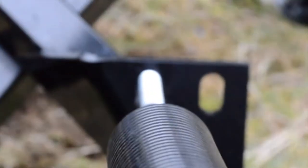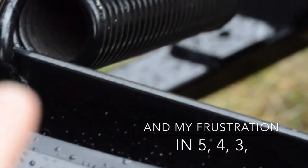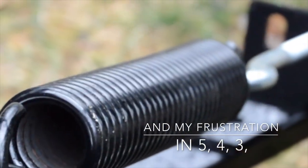Again, in and of itself, not a huge deal. I just went through last night and drilled a hole, grabbed the Craftsman power drill motor and drilled it out so that it's as straight and flat as I could make it to mimic this one. And just so you know, if anybody else ever runs into this problem, the distance from this hole to that center line is 11 inches. So I just went out to 11 and went halfway up, and that's the best we've got. And just so anybody at Snowbear, if you're going to contradict this, you'll realize that that is 11 inches from there, and so is that from center line. So everybody else, if you need to do that, that's where your mark is.